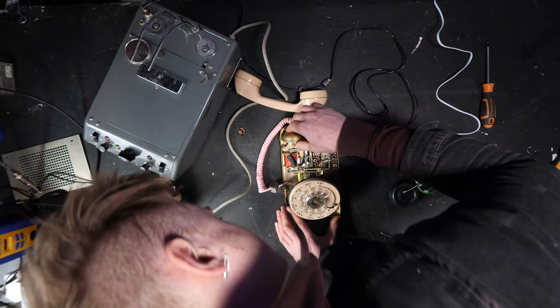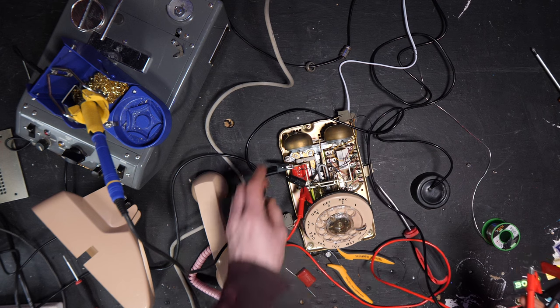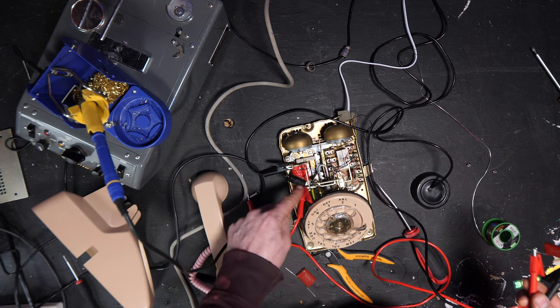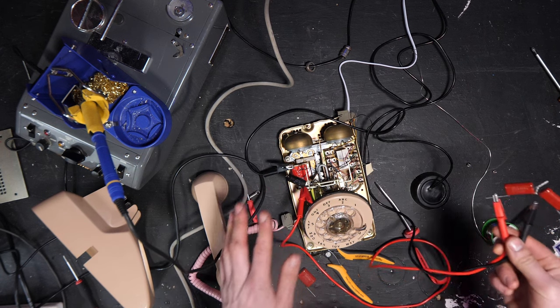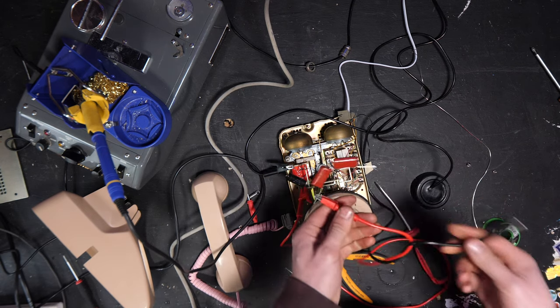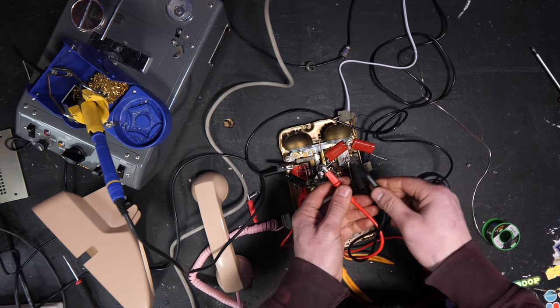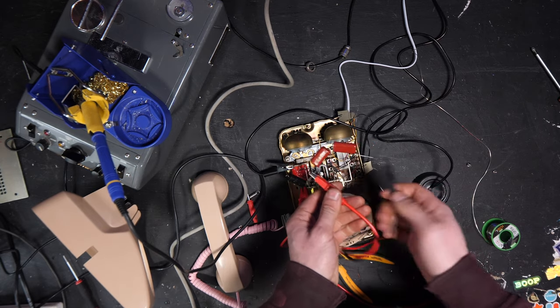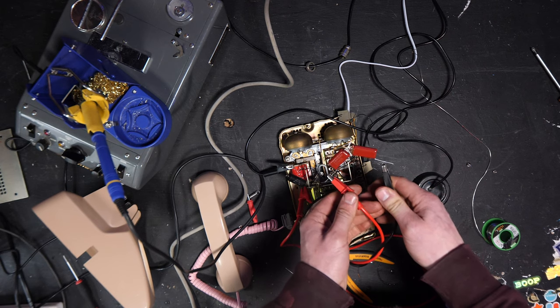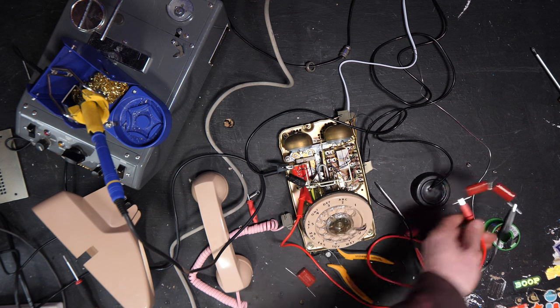I don't even know. So, after having a fiddle round, basically the capacitor that's on here, right here, it's not really working with it, but having swapped that capacitor that goes along the line with a different capacitor, this is about 1 microfarad, it's basically two microfarads in series, which reduces it down to 1 microfarad, and it's got a decent enough... That works enough.